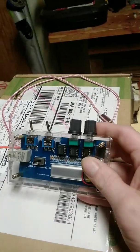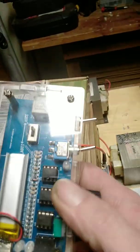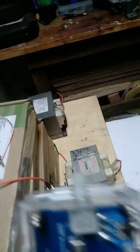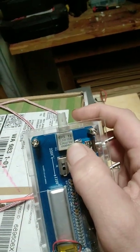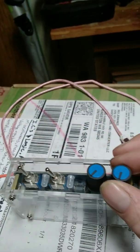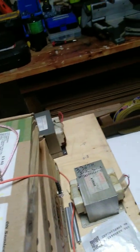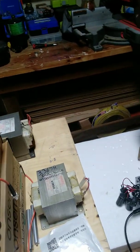It was super easy — I just tacked it together. It's two 555 timers and an LM393 with a fiber optic infrared emitter and a lithium battery pack. It's cheap, but what I can do with this already is more than I had hoped for.